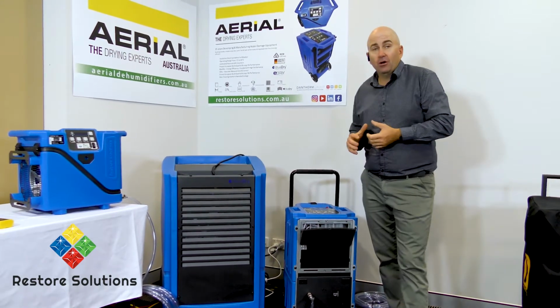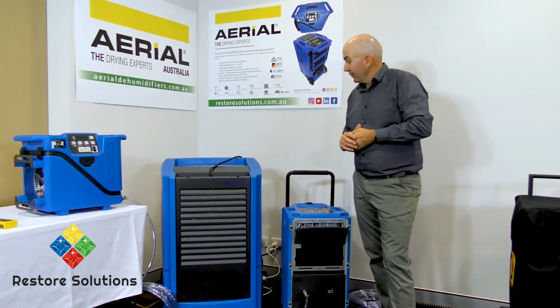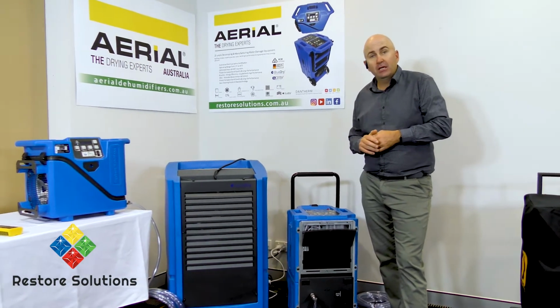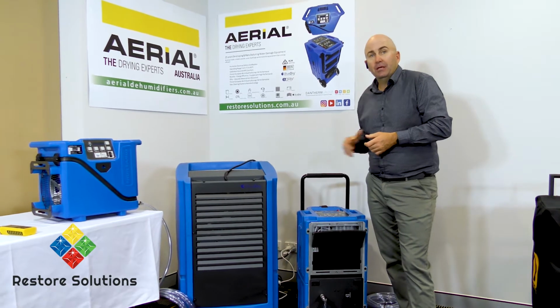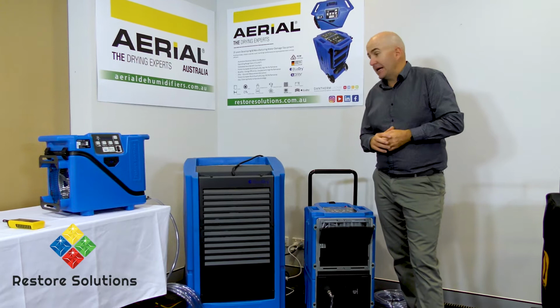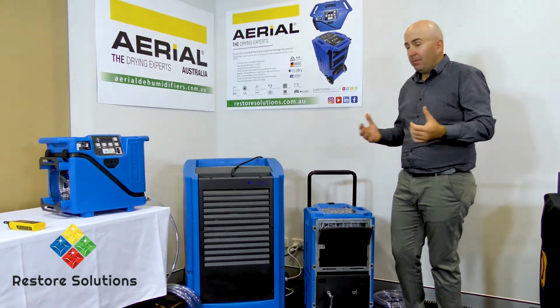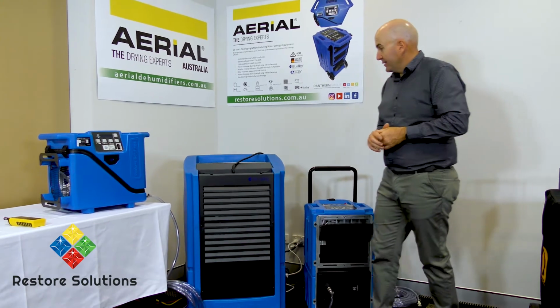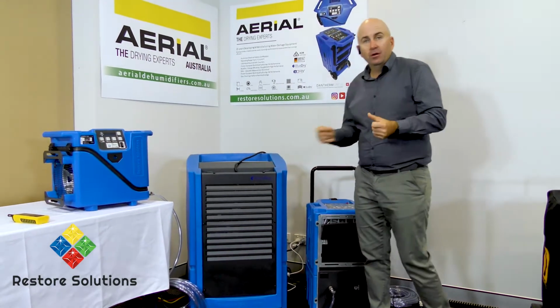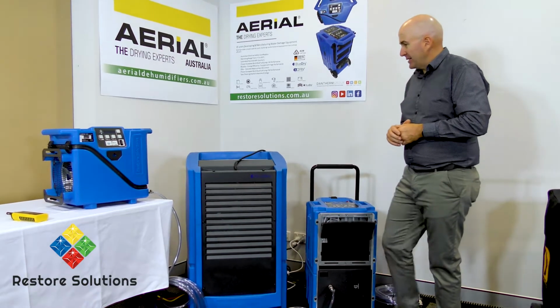And it works down to low grains at AHAM. So AHAM at 26.7 degrees and 60% relative humidity, it will go down to 30 GPP, 30 grains per pound. So it gets very dry air at AHAM. Very robust machine. It's got a great pump out system on it. Very easy to use, dial control, turn it on, away it goes. So that's a little bit about our 8780.